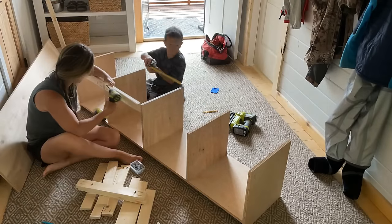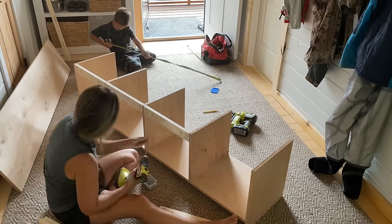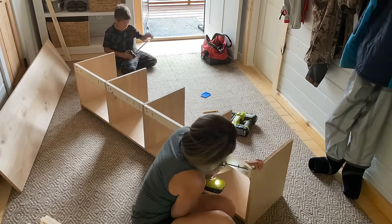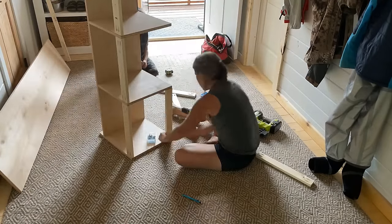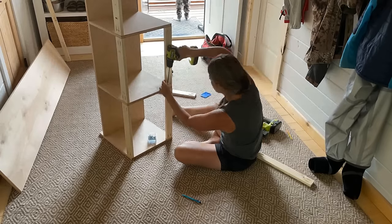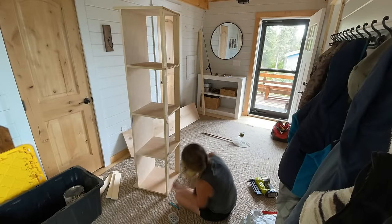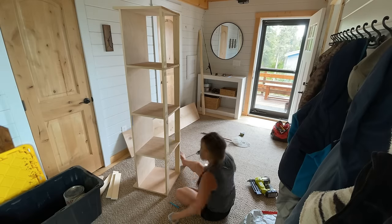For the base supports, I use pocket holes on the back and I'm going to use them also on the top, and this adds quite a bit of strength to the project. One thing I've learned over the years of building, especially with pocket holes, is you want to use gravity to your advantage. Just by turning this project and pushing the drill downward and using the weight of the bench to hold the board in place, I was able to build this project without using any clamps.